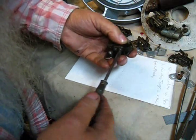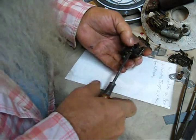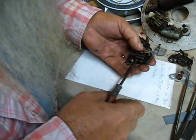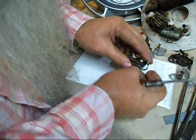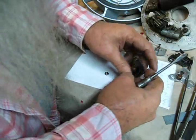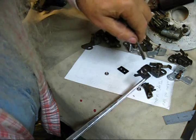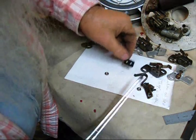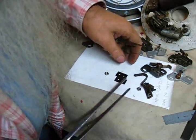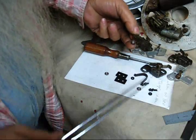When you get stuff like this home, take it apart. Look at all of the parts. Somebody put it together, so somebody knows how to put it back together — it's in the book. Take this apart in all seriousness, get it out where you know what you've got. Be careful with that spring right there — so hard to get that little item. Disassemble all this, just get her apart. It'll only go back one way — the correct way. I don't know if you can see that or not, but it kind of looked wet or glossy across through there — could be oil. A lot of chemicals will short the system out, so you want to clean all this up really, really good and put it all back together.